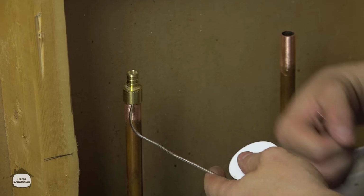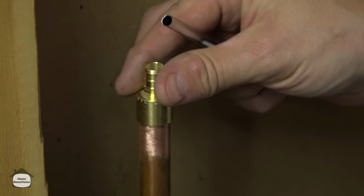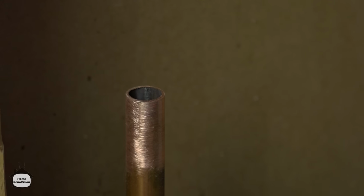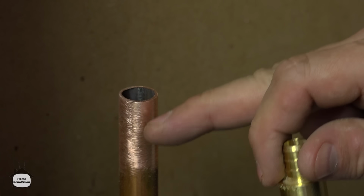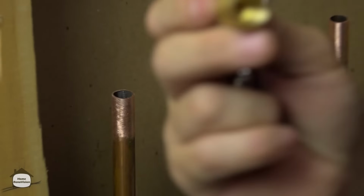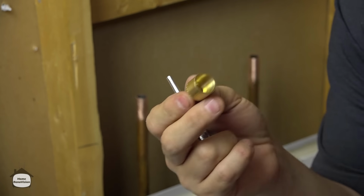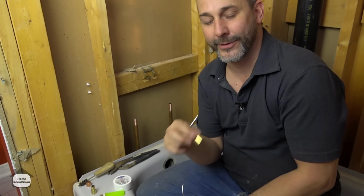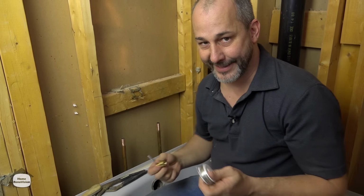and you add the solder from the bottom, all right? So what you want to do is create a nice clean scratched up environment so the solder has somewhere to sit. And you're basically sealing it for the whole width of the joint. All right, so you end up sealing it about 50 times more than is necessary, and that is the goal, to get such a good clean joint that there's no risk of it ever leaking, and then you can sleep at night.